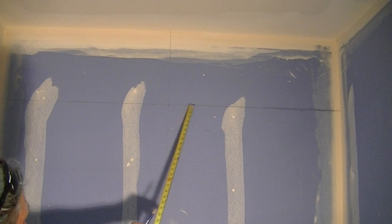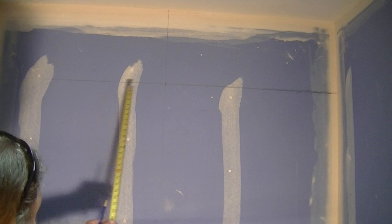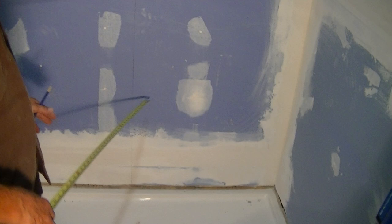Here's our spot. You can see the line right there. What we're doing is making a control line on our grout line, and this is where I'm going to pull my measurements — this is called a horizontal grout line. Then I'm finding center of the wall, coming down, and plumbing this down to make a vertical control line. That's going to allow me to take my measurements on the width.